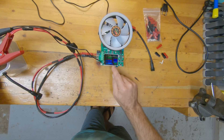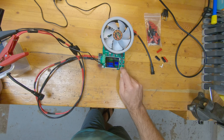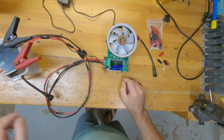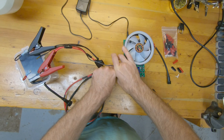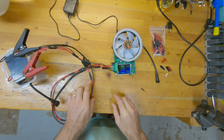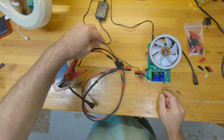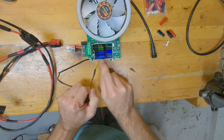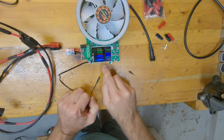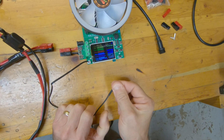I'm going to pause the discharge on this unit — it's going to save the information. I'll unplug my setup using these Anderson Power Poles, which I'll talk about in a second. There's also a thermocouple temperature probe here — you can see the external temperature reads 26.9°C. I'll put my thumb on it and you can see it climb.